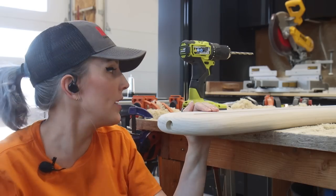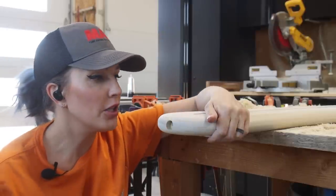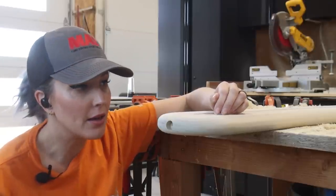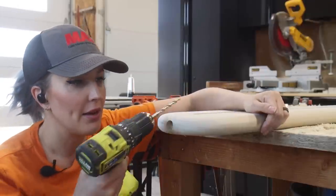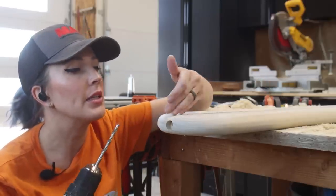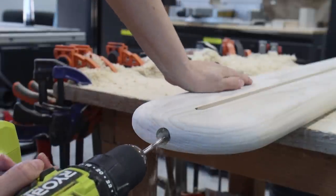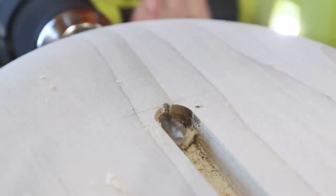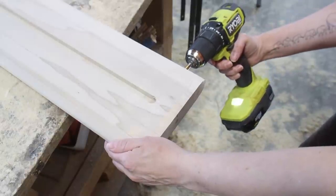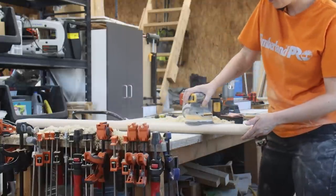I've got another tricky job to do — I need to connect the top hole I drilled on the arch to the dado that I cut through the middle board. What makes this tricky is it's not a directly straight line; I'm going to have to split the difference and go at a shallow angle. I'll draw out a pencil line so I have a direction to shoot for. I'll start with a smaller quarter-inch bit so I can make adjustments if needed, then open it up with a larger bit. At this point it was also a good idea to give every board a good sanding, really smoothing over those round-overs.